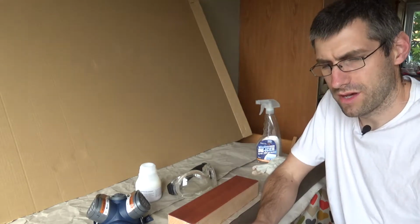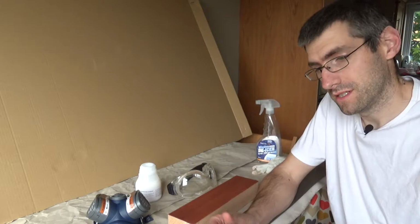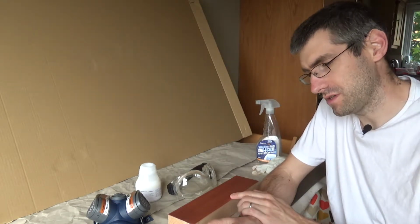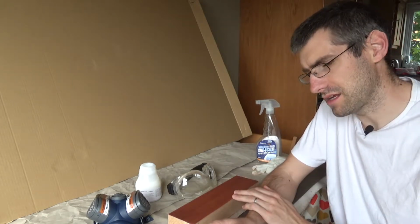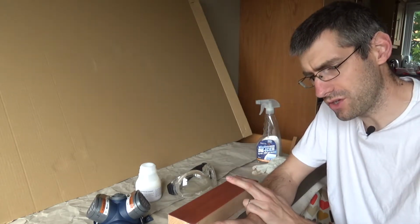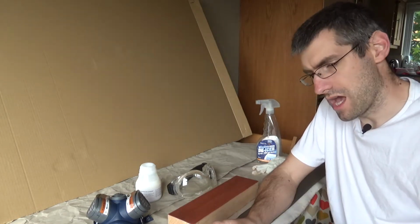So day one, sanded to 240 in condition, left overnight. I even made notes, you see. Hardcore. So it had the brown, which was the brown and red, the first one, sanded again to 240 to simulate me taking the stain off. Once, brown with red again and sanded with 600, and then two coats of brown, but the faded brown red type this time, and then left.